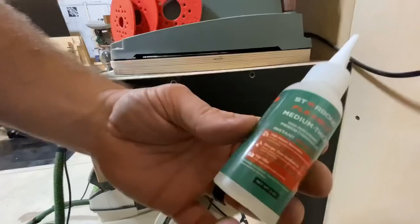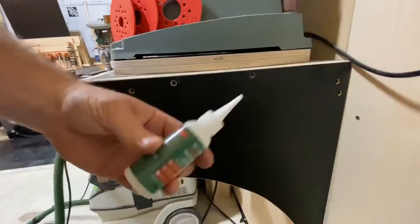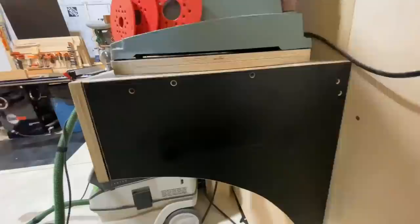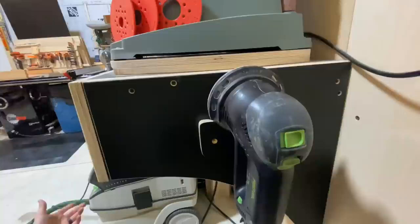Now it's time to attach this piece to the side of my spindle sander holder. I'm just going to make a quick mark and use some CA glue to attach it. So this process goes like this: take some CA glue and put it on the surface of one piece, then on the other adjoining piece apply activator. Place it and look at that — within a matter of seconds it's strong enough to hold a holder for my random orbit sander. No mechanical fasteners are on here yet, but I'm going to drive those home. Look how strong that hold is on two pieces of laminate.